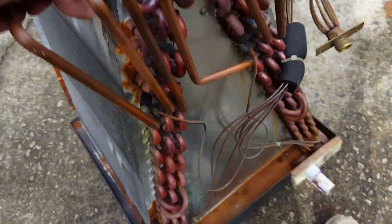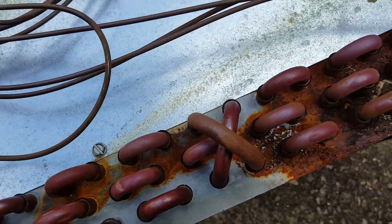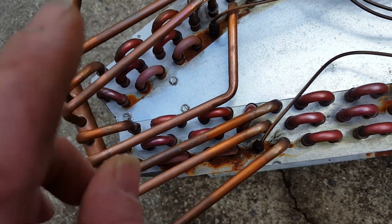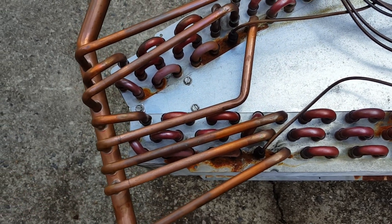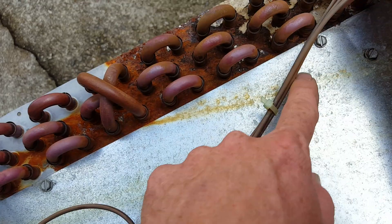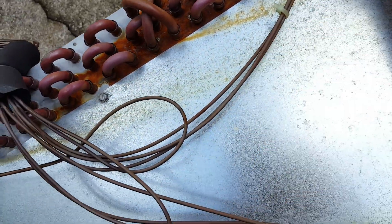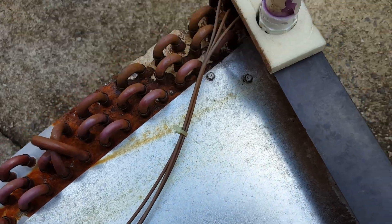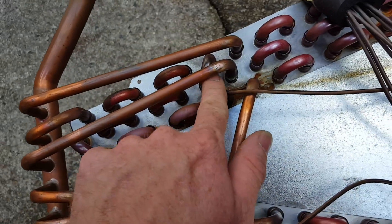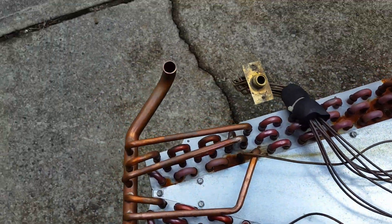On the front side — actually, what I've found is there are more backside leaks than front side leaks when it comes to coils. So what you can do is take a mirror around to the backside and look for those telltales. You can see one here — that's a telltale through this area. Now you may say that looks more like rust, but if you look here, it's actually the oil that makes the difference — the oily residue. And you can see this one here is kind of real shiny from the oil.